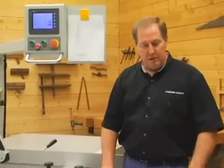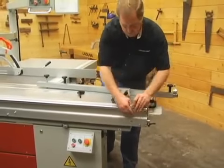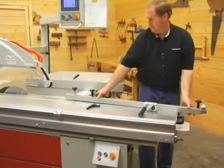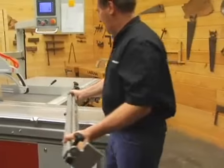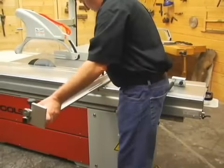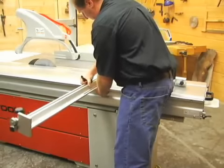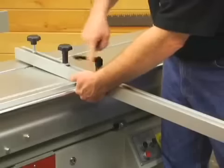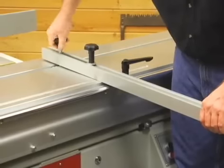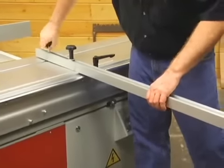To install the miter cutoff fence, we're simply going to remove this handle — it loosens and slides right off. We're going to slide on the stop, and this is a nice polished hard chrome steel shaft right here. That slides on and that's going to be our pivot point. This will drop right into the center pivot and I'm going to loosely thread that on. This will slide over and come up, and then we're going to install the handle — that'll spin right on. Now I can snug it down, leaving it a little loose so I can adjust it. I'll line it up exactly at 90 degrees and I'm ready for a 90-degree cut.